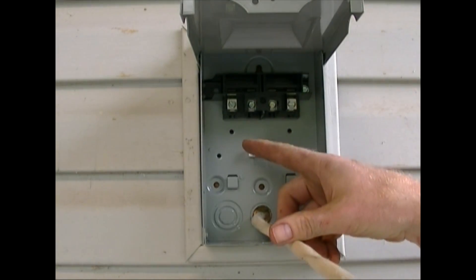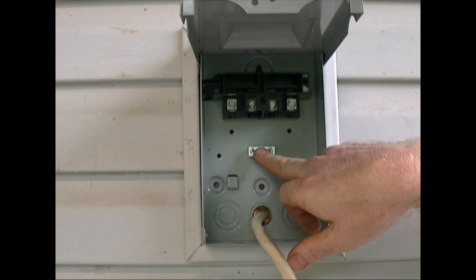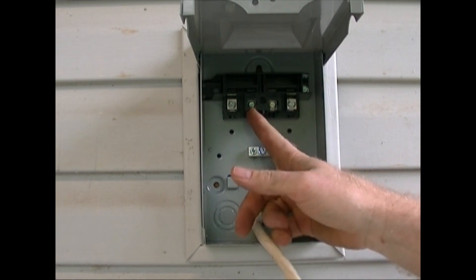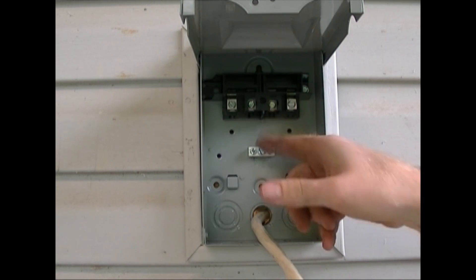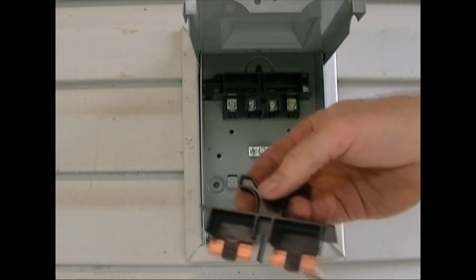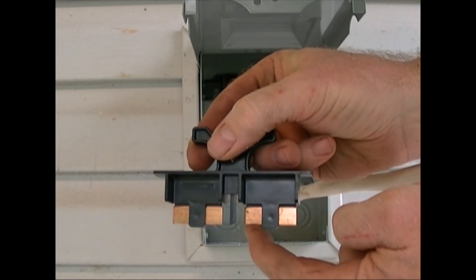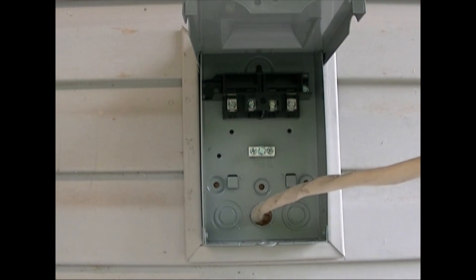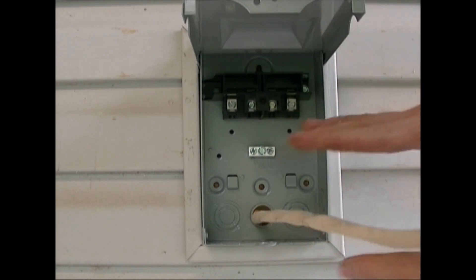To wire this box up, we'll run our bare copper wire to the ground here, and we'll run our red to the inside lug — it says 'line' on here — so red to one side and black to the other side. Then when we put our shorting bar in, which has copper plates on it, it'll contact from the center conductor to the outer one — line to load, line to load. When the air conditioner technician comes, he'll hook up his load to these outside lines, so I'll just hook up to the inside and leave it.